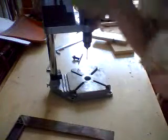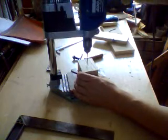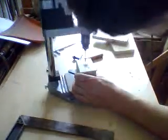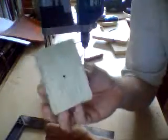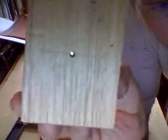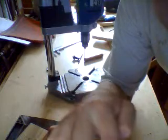It goes well. I already did it with the punch and it seems it found the place. I can see the light going through it, so I will drill it now. So we got a pilot hole now, which we will drill larger later — as you can see the light can go through it. Later we will drill that hole bigger for the shaft. But first we have to find a spade drill of 22mm wide, which is the diameter of the skate bearings. I will have to look for it, so I will show that in the next video. Thanks for watching.